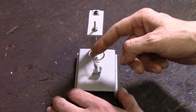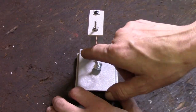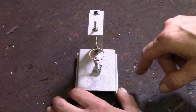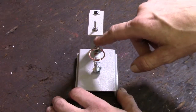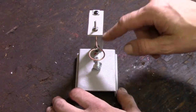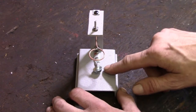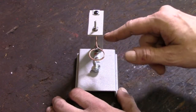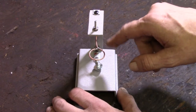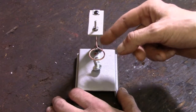I've got some thin gauge magnet wire. Then I took some heavier gauge copper wire and I just used a piece of PVC pipe to make a nice little circle, and soldered it together. So we've got two terminals — one terminal that hooks to the little loop, and the other terminal that hooks to the little wire. Both of these were enameled, so I just took and sanded them off, got them nice and clean, and then I tinned this wire just to make sure it was good and clean.